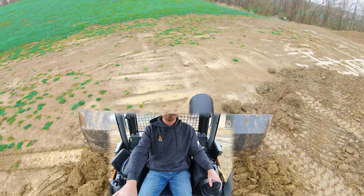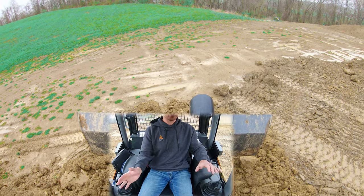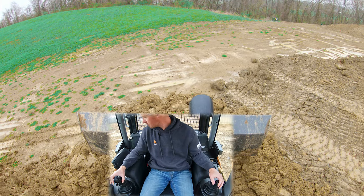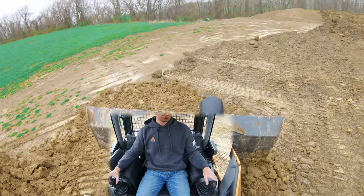Look at my blade — I'm still pretty level in relation to my tracks. The only reason we leveled out there is because I didn't have any more material on the left side of my blade; we were still adding material to the right side, which brings us level.